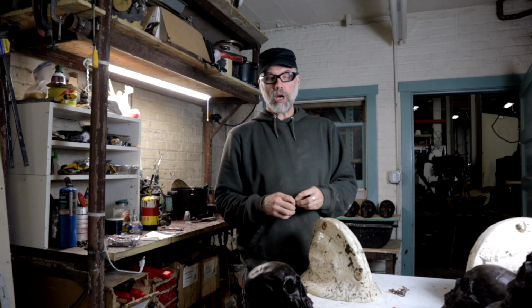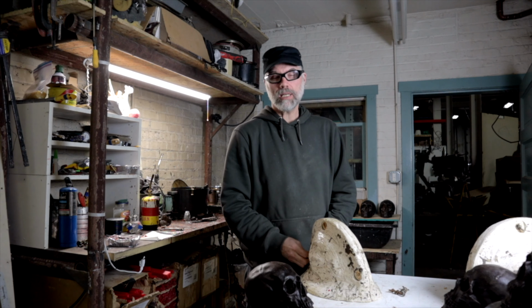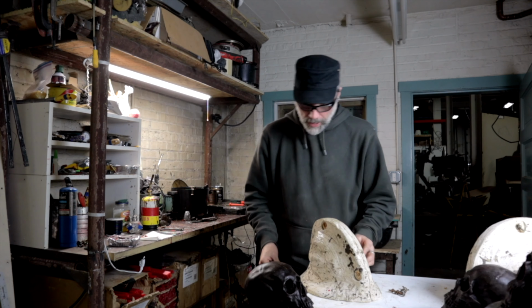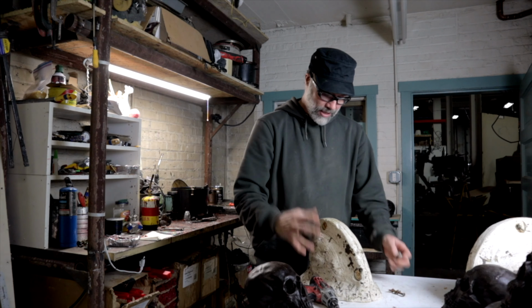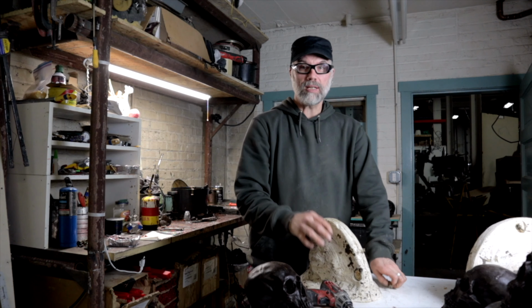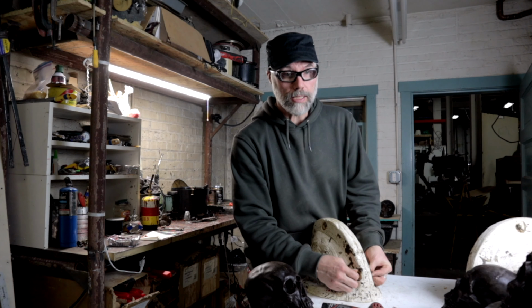If I'm going to do any kind of long-term storage, where it's going to be more than a month or a year in between castings, you want to slush coat a few coats of your wax in your mold. The rubber itself can potentially degrade depending on the quality of the rubber you're using. Some rubbers, as they age, actually break back down to a liquid or want to distort. So we can cradle that rubber, entrapped by the mother mold on the outside and a wax pattern on the inside. It'll maintain the integrity of the rubber and keep it from being exposed to the environment. Depending on where you're storing your pieces, you'll find that your molds will last a lot longer as a whole.